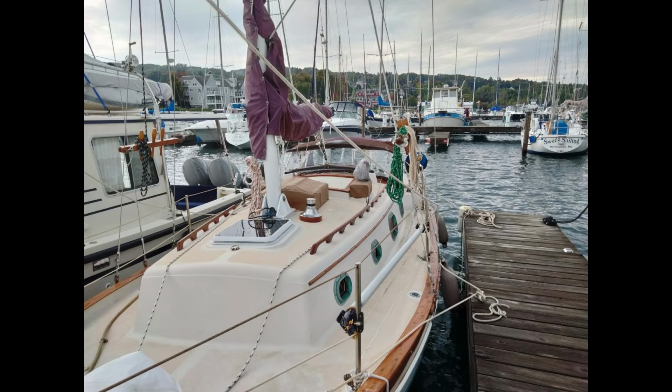Ideally, a Charlie Noble or stovepipe coming up from below in the cabin should be out of the way of boat handling tasks on deck. Since I need at least 4 feet of stovepipe for draft, it'll likely be an extension of stovepipe going skyward from the deck. I have to make sure that the boom, sail, and running rigging will be clear of the exhaust.